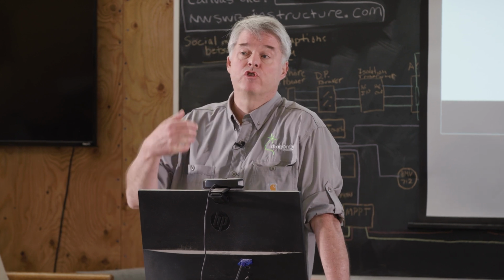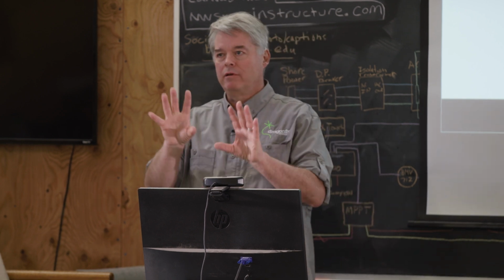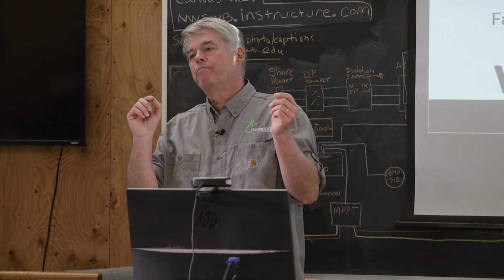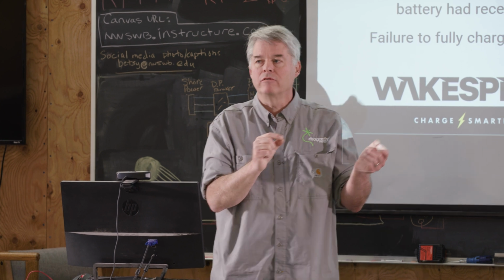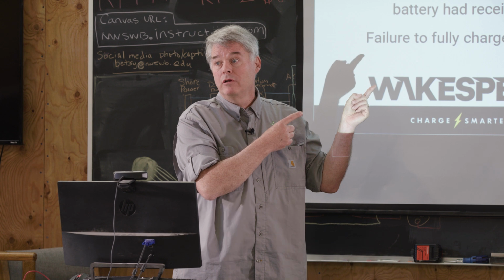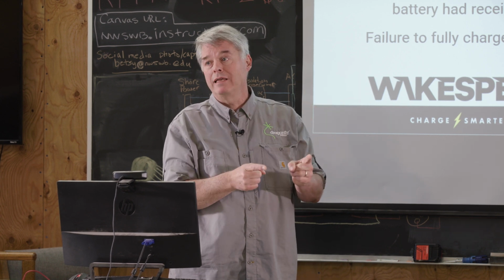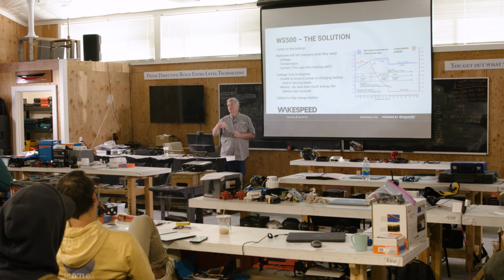So even if you've set something up, and I'm trying to finish up here because it's time for a break, but I'll finish this particular topic. There are some products out there that actually do this, but they don't do it by measuring the alternator current. They do it by measuring the field drive, and it's a current proxy. Remember how I told you that alternator output is a function of how hard you drive the field, and its temperature and RPMs? Well, in a controlled environment, you can take all that information and you can know how many amps are coming out of the alternator.